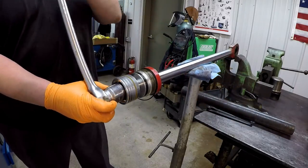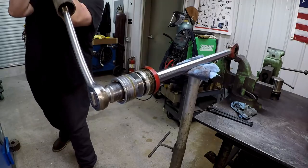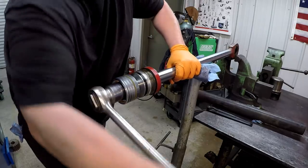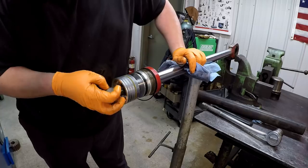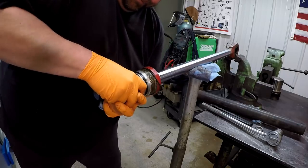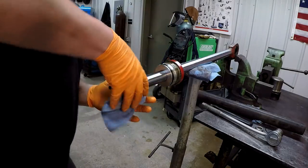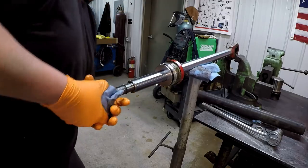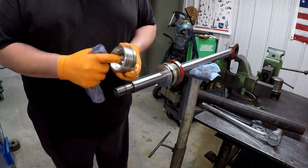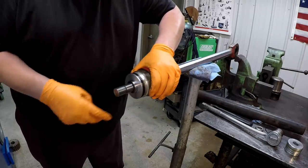About an inch and a half socket. Some extra leverage. There it is. The O-ring had that thing stuck. There's the O-ring, which is what seals the oil from creeping underneath through the bore of the piston there. All right, and then this is going to be our main issue that we're dealing with.